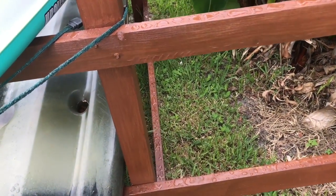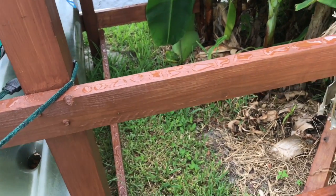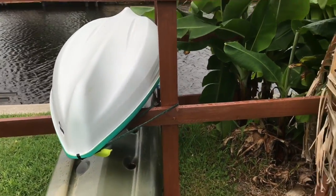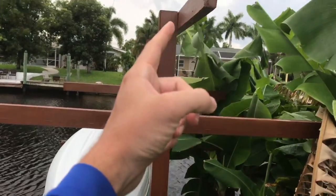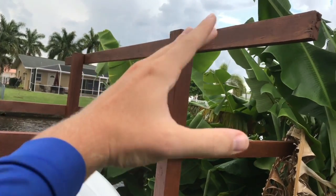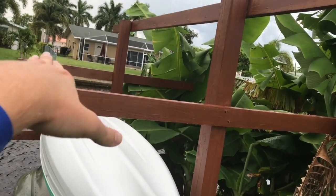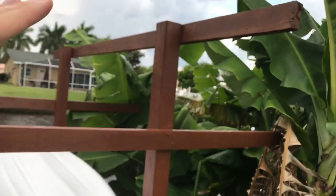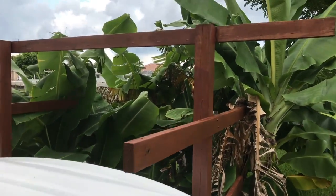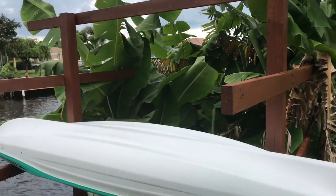You'll notice that the water just sits on the surface of the boards — that's because I used Thompson Sealer, a deck sealer, in the color Acorn Brown. I ended up leaving an overhang here because the thought was that maybe I'd put another rack on the other side and create some type of covered overhang, putting some plastic or metal roofing across to provide extra shade. But really, these banana palms and trees here provide decent enough shade.